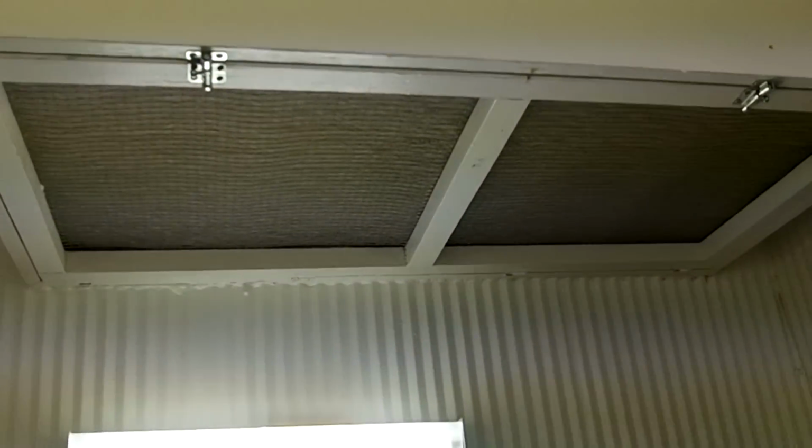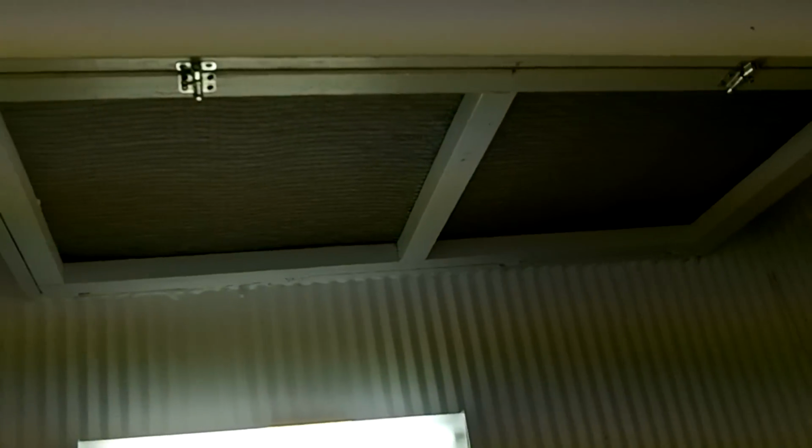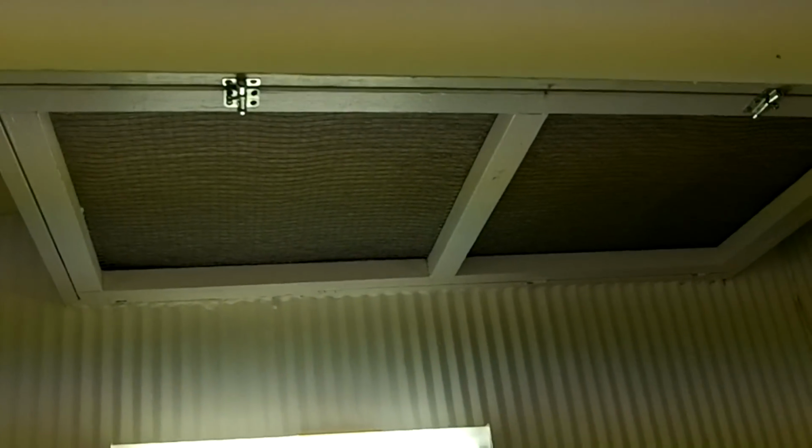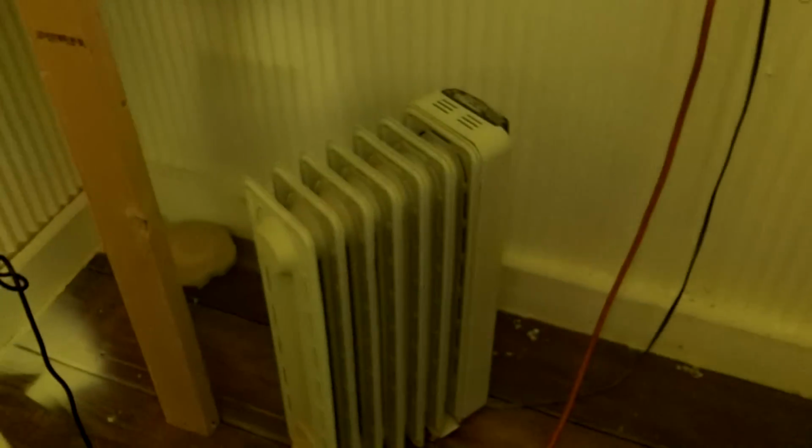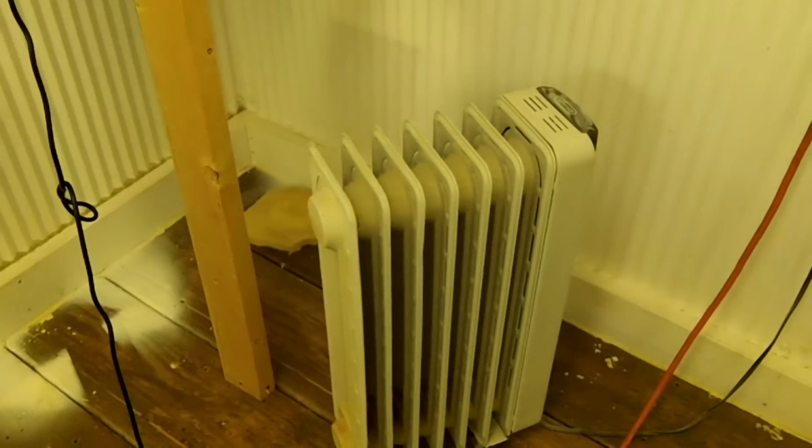And we'll go back around here, and overhead I have an exhaust fan that actually pulls air in, and the air coming in gives me a positive pressure inside the room all the time, so it doesn't suck the dust out into the room. I have a little heater down here that I turn on sometimes. It's sparkless, to dry the air out and to help dry faster.